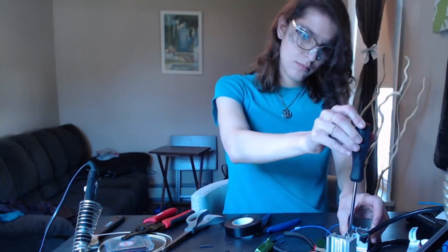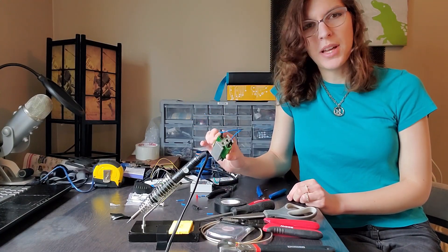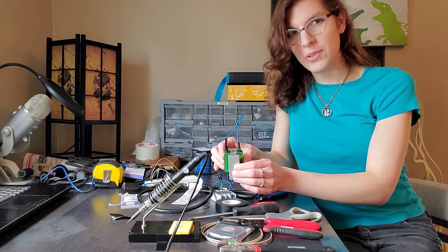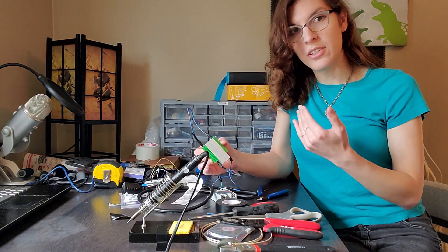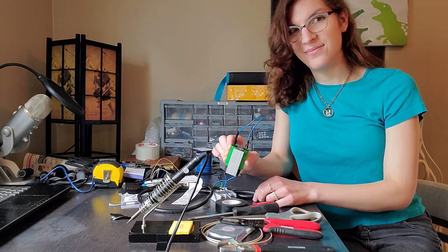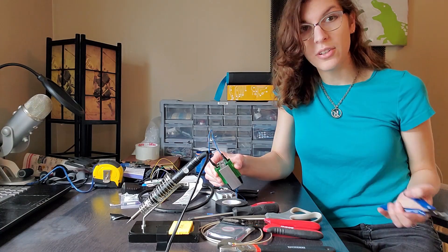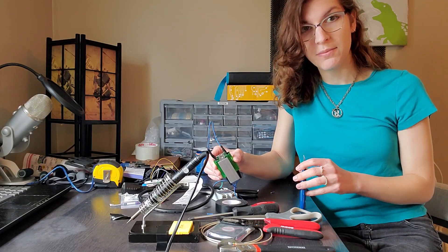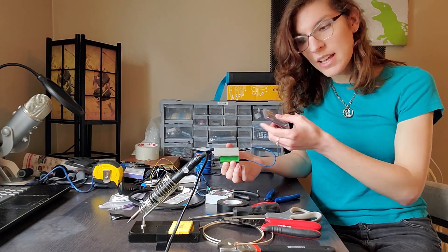As I was finishing up the construction on the resistor circuit I realized there was trouble in paradise. The more I'm building this, the less confident I am about it actually working. Traditional PCR machines increase the temperature by around five to six degrees per second, and using just two resistors to heat this thing up — I read the numbers and it's not going to work. The blog post said the entire cycle time for this design was close to three hours, while traditional PCR machines take 45 minutes. It's not just that it'll take longer — the reaction will fail if it takes too long. If the temperature doesn't ramp up or down the right way, you're not going to have consistent replication of your DNA. The other problem is cooling — there is no way you're going to cool something five to six degrees per second this size with a fan.